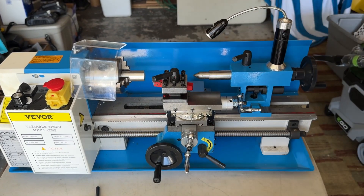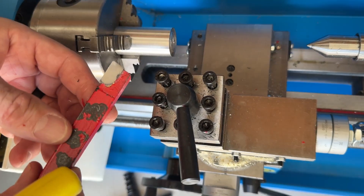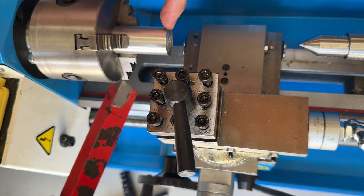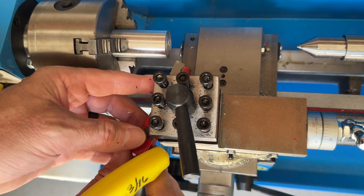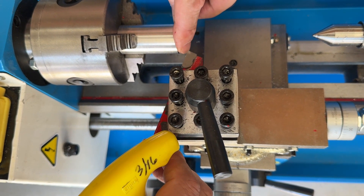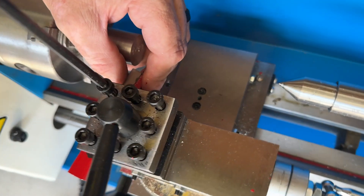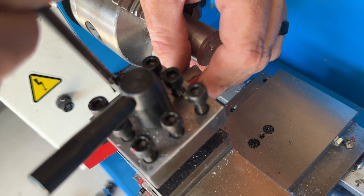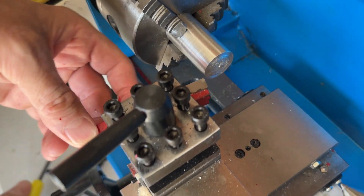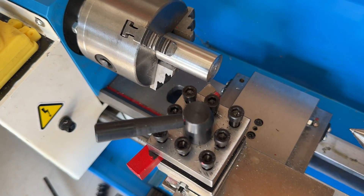Now let me show you how to use it. Let me install a metal cutting bit — you can see this edge is a little beat up, it's a carbide edge. Here's a piece of aluminum stock. So what you do is take this, put it in there, estimate about where that tip — this is the cutting edge — will contact your material. Lock it down right around there, get an Allen key, and tighten down the screws so it's nice and tight. Any movement at all is no good — it means your cut won't be consistent.